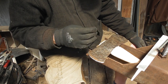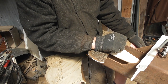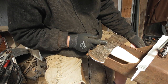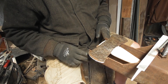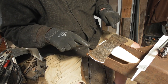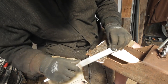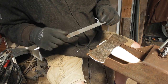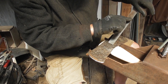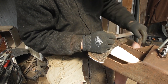Right now it's in the jaws that accept a double bit. This will also take a Pulaski, it will take a shovel, and it's to emphasize the use of parallel filing with the blade, not filing into the blade. Just follow the lines on the file to be parallel with the blade.